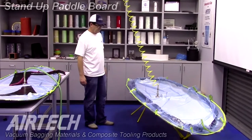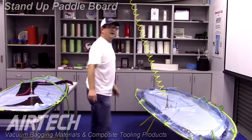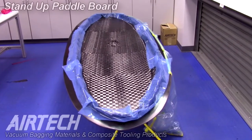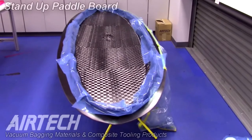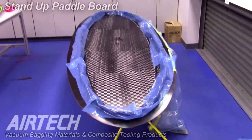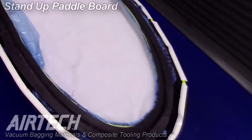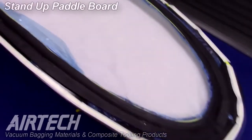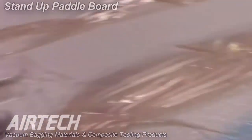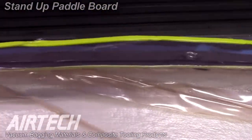A little bit more work and we'll show you how to vacuum bag this. We put the action bag on there and then draw vacuum on it so we can have a nice preformed flange before we put the bag inside and put the top half of the board together. We fold the overlap extension over and now we have the frame in place. We put breather on there, reach under the flange, make sure everything feels like it's in the right place. Then we're going to pull for the handle, and we've tucked the nose under — so we're not bridged anywhere, and this should help us by preforming that overlap.